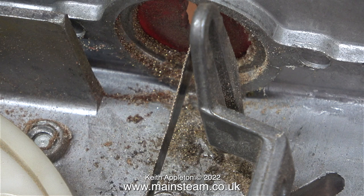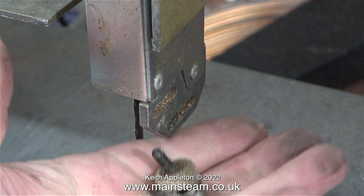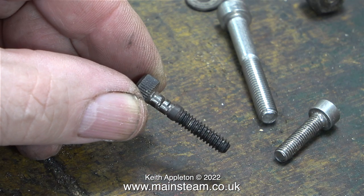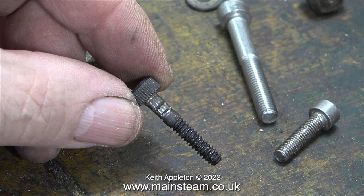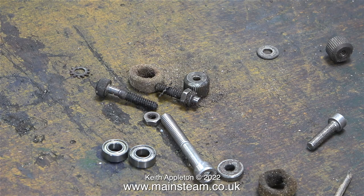I'm going to use a ball race for the blade to press against when cutting, but in the meantime I've removed the bottom fitting to see how it's put together. This is the bracket that normally supports the top blade guide, and here's the bottom blade guide in my hand which is still in one piece but only just. As part of assembly there is a felt pad which you're supposed to oil periodically, but I've never oiled it because I didn't want the oil to contaminate the wood I was cutting. This is the bottom blade guide shaft and as you can see it's nearly cut all the way through — done by the back of the blade, not the front bit with the teeth.